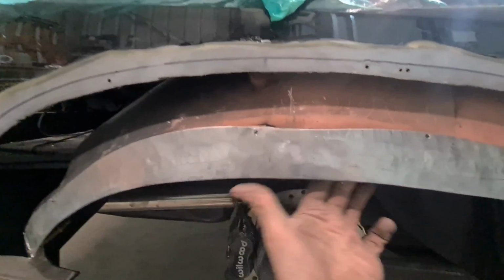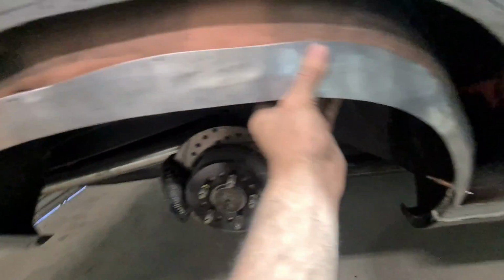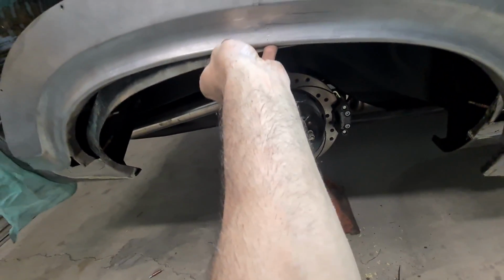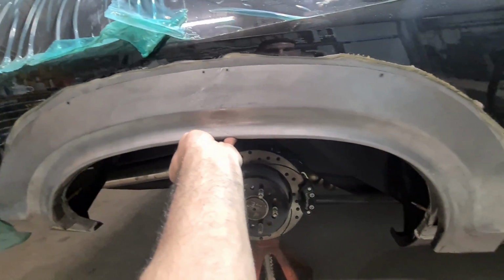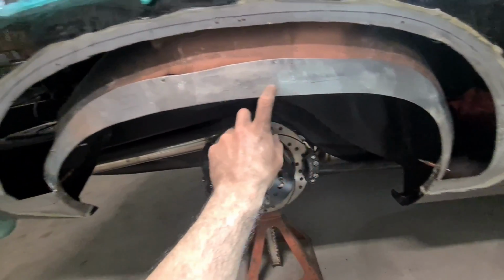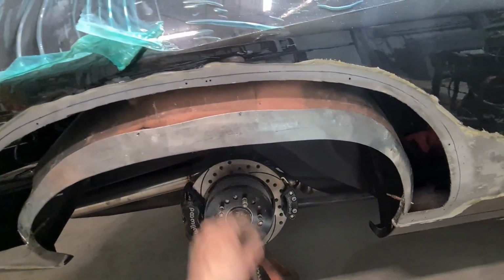Okay, so inner arch extension, which is making that 30mm longer, and I should be able to join past the bogged up mess which is about there. Should be able to join to the fresh tub, should be nice. So now I just got to keep trial fitting the outer. So hard one hand. Yeah, keep trial fitting the outer until it fits, and just keep trimming off here until I get it fitting nice and snug along the edge, and that'll be sweet to weld this in.